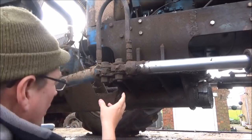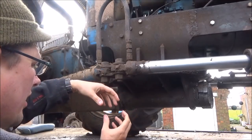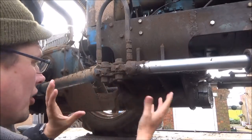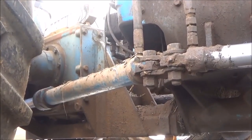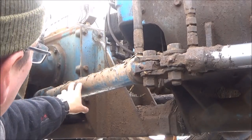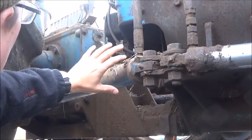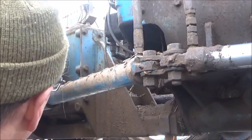A lot of manufacturers with articulated tractors went with a system like a loading shovel — top and bottom, maybe a middle unit, with a pin right through. But these have actually gone with a turntable. All it is is bolted on the back of the axle housing — you can see the six bolts on the back. Where normally you'd have had the top link and all that on a conventional one, they've just gone straight on the back of that.